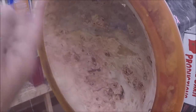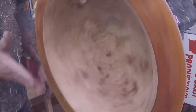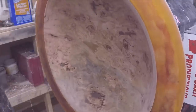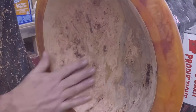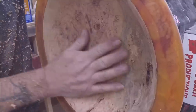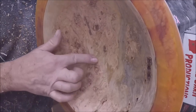I'm gonna put just a sanding sealer on it, and I got a lot of leveling here to do because this is all moved with the bowl itself, even though this is rigid, but this has got some lumps in it I need to sand out because it's moving. And I will not force any of you to watch that. That's really cool looking. There's a little bit of a whoop-de-doo right here I couldn't get out, and I was afraid I was gonna get a really bad catch, so I'll just see if I can sand it out. It's just this one right here.